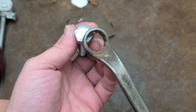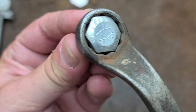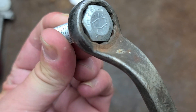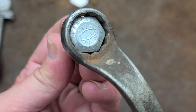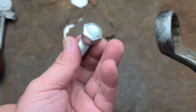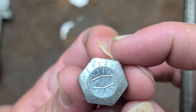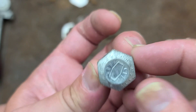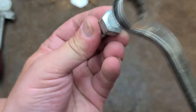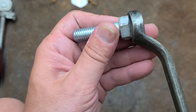Obviously going with the six-point is going to make a bigger difference than fluted or non-fluted twelve-point. That being said, this happens to be a pretty high-grade fastener — a super tanium — and we can see this bolt just barely rocks around in there; it's actually a surprisingly tight fit. One disadvantage to really tight-fitting wrenches is if you already have a bolt that's a little bit rounded off, or there's some damage or a little bit of metal sticking out at one of the corners, it can make it pretty difficult to put the wrench on the fastener when it's deformed in any way.